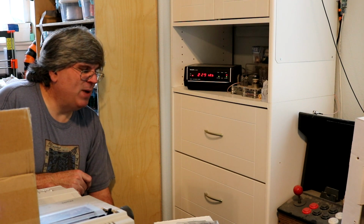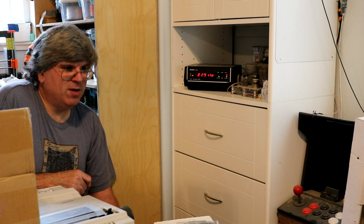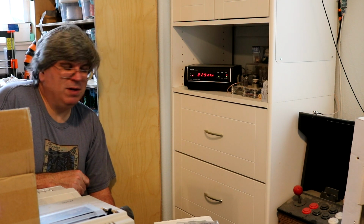It's in Hi-Spec mode right now, and day and night it's syncing routinely with 5 MHz, with 10 MHz, with 15 MHz, just as it's supposed to. The Heathkit manual says anything above 50% is really good, so at 85% we're well above 50%.